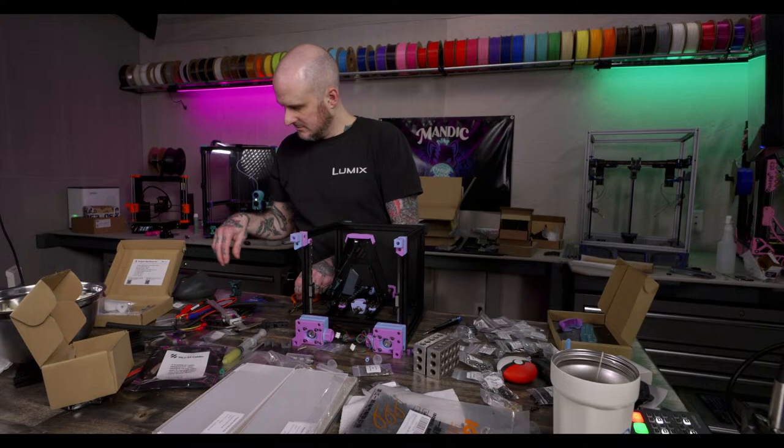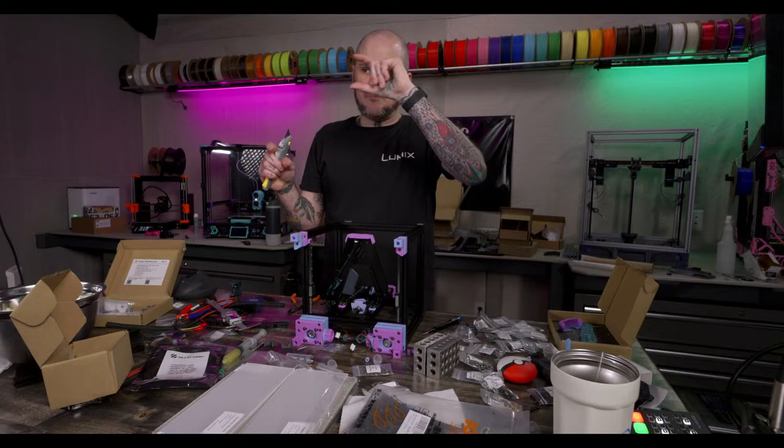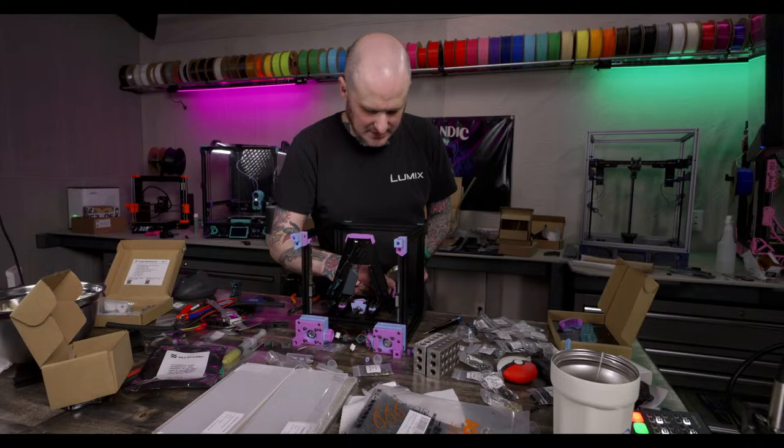I haven't tested the Obsidian high flow nozzle on the Revo yet. I have some, I haven't tested them. And I haven't tested the Panda Revo yet. But everybody I've talked to says the Panda Revo with high flow nozzles does not flow as well as the actual E3D Obsidian. My Obsidian, I'm running at like 40 millimeters cubed all day long. A few people I've talked to say they barely break over 30 with the Panda Revo. Again, I have not tested that. I don't know, but I was unimpressed. Part of why I haven't gotten to testing it was, if that's how it's going to be...